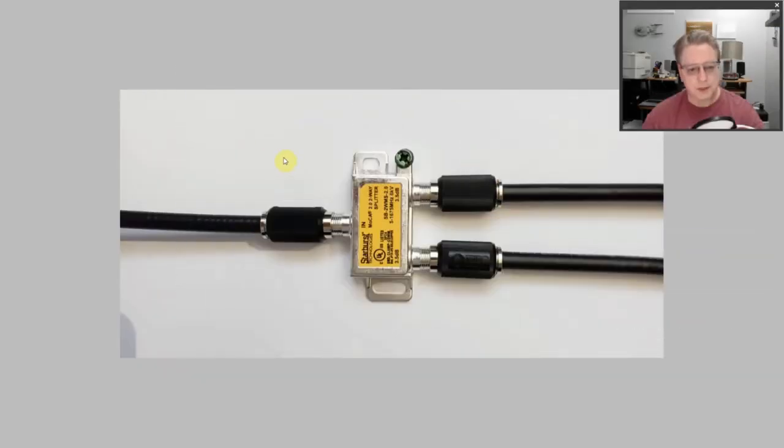Here's an example of what a typical splitter looks like. Let's say that in our case this is the coax that's coming in from the ONT, and it comes into a splitter that's fairly near your router. One of these leads is going to go off to the router itself, because the router is getting the internet on the MOCA WAN that's on the outside, filtering it back and putting it on MOCA LAN, which is going to go back out to the rest of the house. Also, your live video stream is going to the rest of the house.